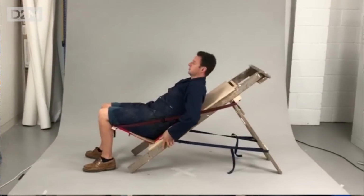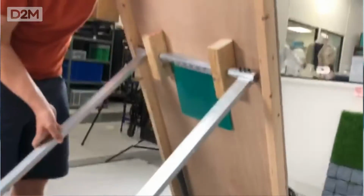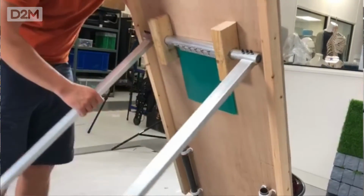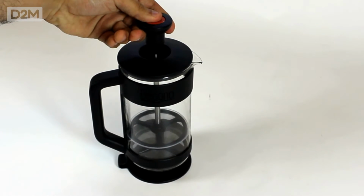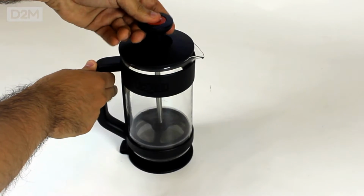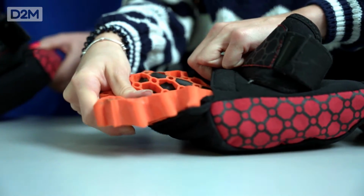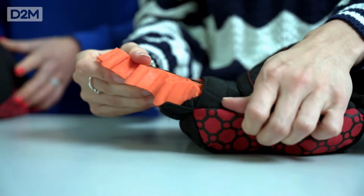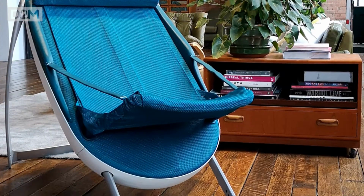Now the reason to do this is that if you don't, you can invest a lot of money and a lot of time in a full looks-like, works-like prototype, only to find that the basics don't function correctly and need to be further developed and changed. And by that point you've wasted months and wasted thousands of pounds. The key is test the core, risky bits of your prototype first before then investing in later stage different prototypes that have got all the features that do look like the final thing and that maybe are made in materials that better represent the final product.